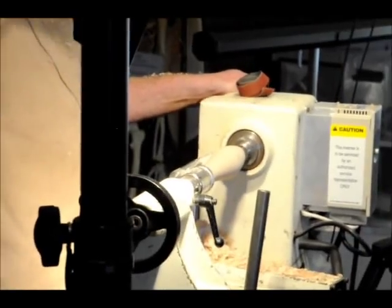There's some mark. When it curls, you got all that end grain. Every one of those curls presents end grain to your surface. There's a spot there, so I can go back up to, of course, I sometimes find I start with a fine grain where I want to be, because then the other places show up. If I start with a coarse grain, I'm doing a lot of sanding I don't need to do. So now I can see that spot where that little tool mark was, and I can focus just on that area.